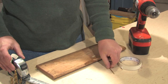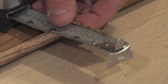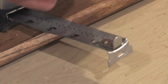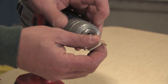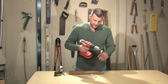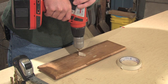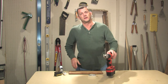So we're going to take a piece of masking tape, our drill bit, and our tape measure, and we're going to tape off our drill bit at a half inch. That way, when we drill our hole, we're just going to drill down to the edge of our masking tape, and that will ensure that we only have a hole that goes a half inch in depth.